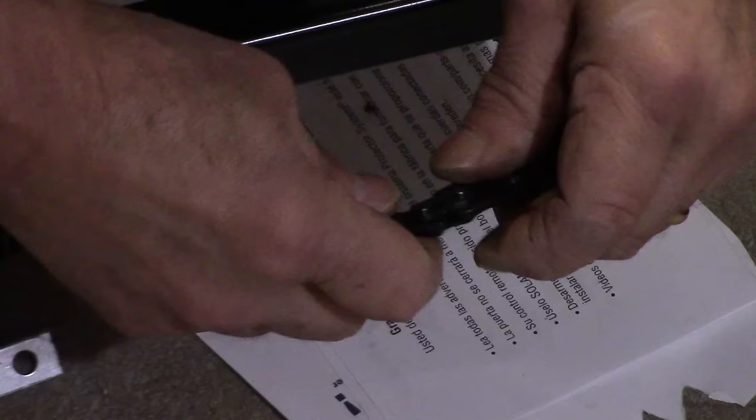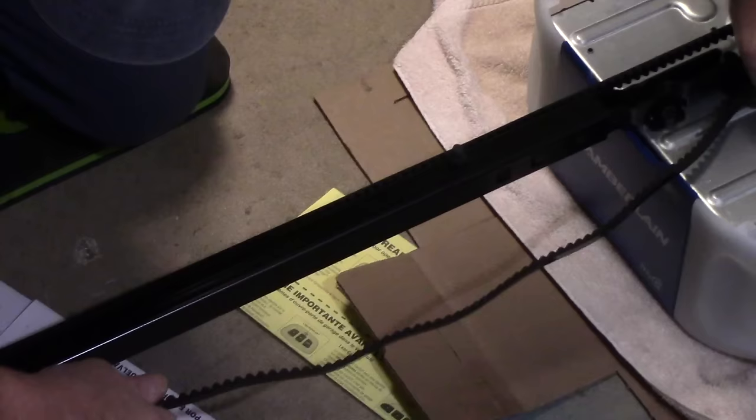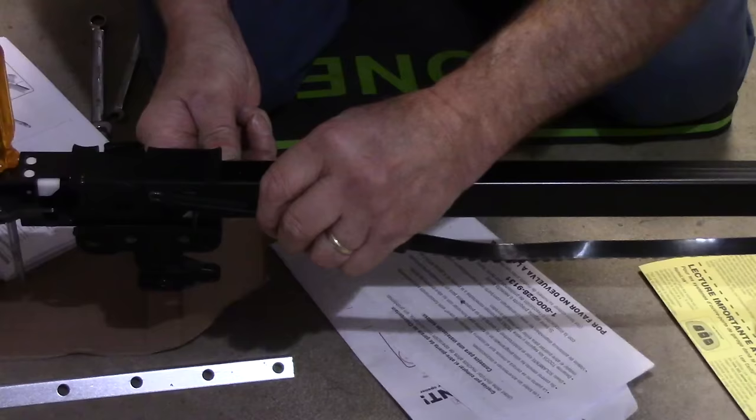And then we're going to make sure our belt is on straight and that it's not twisted at all. So we're going to pull it straight. We're going to pull it around our motor here, like this. We're going to come through here. So this flat part needs to go against that flat part right there. So we're going to take it, put it through here like this.